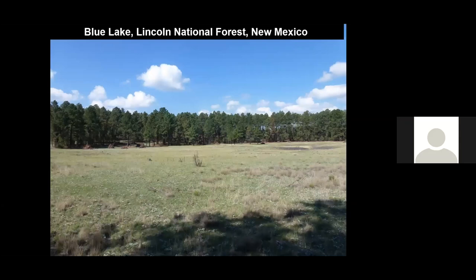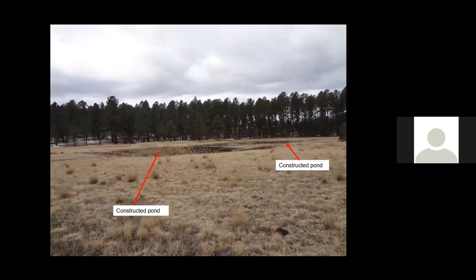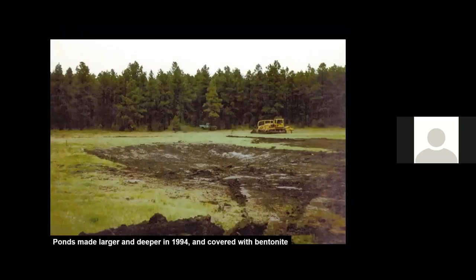Here's the site — it's called Blue Lake. It occurs at high elevation in a basin without a stream entering, surrounded by Ponderosa pine, largely a dry meadow that has not held water for many years. Many years ago somebody dug a ranch pond in the center — Blue Lake used to hold close to two meters of water and now holds none at all. The Forest Service tried to seal it with bentonite in 1994, spending close to $30,000 — it did not seal it. Bentonite is not effective for sealing permeable soils; I have never had success using bentonite. They also built a fence around Blue Lake thinking cows were the problem, but that didn't make any difference.